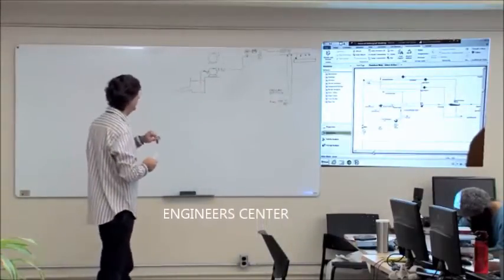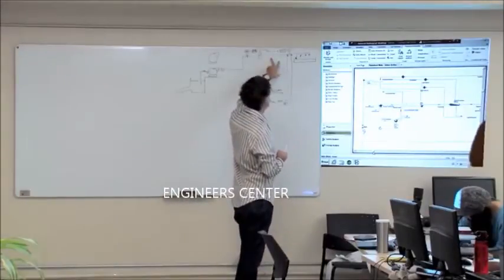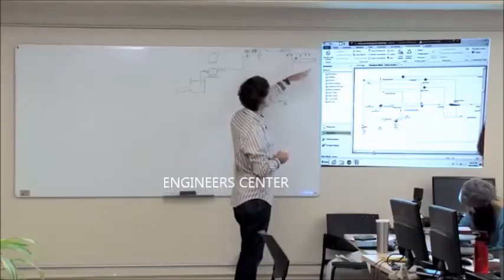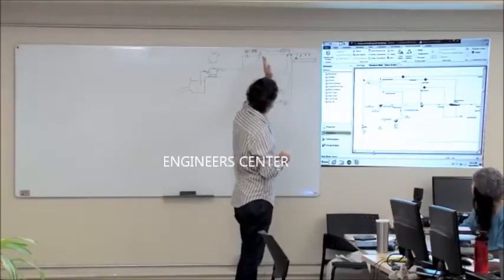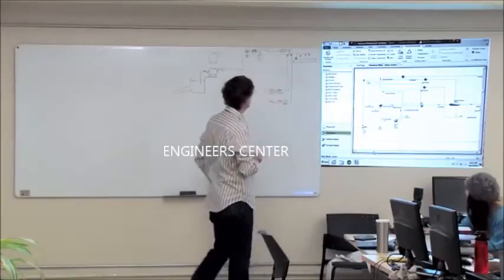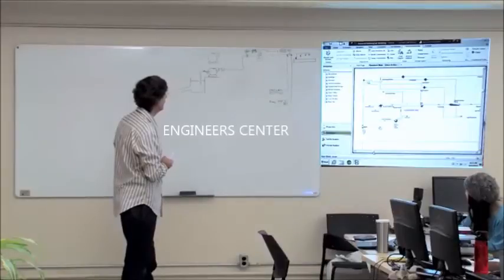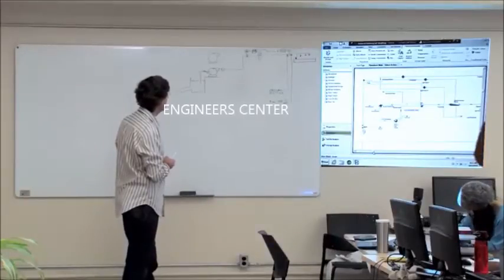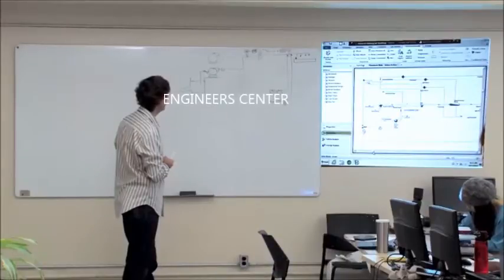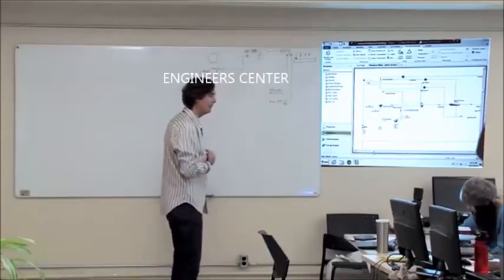Probably what we could do is, this could become a complicated analysis if we tried to analyze the pressure drop between everything, but we could also just look at the furthest place we've got to pump stuff and make sure we can pump the right flow rate up to that raceway. Yep, this could get interesting. And I thought it was going to be simple.